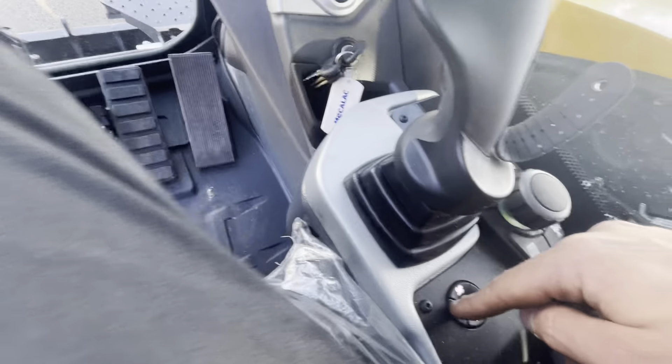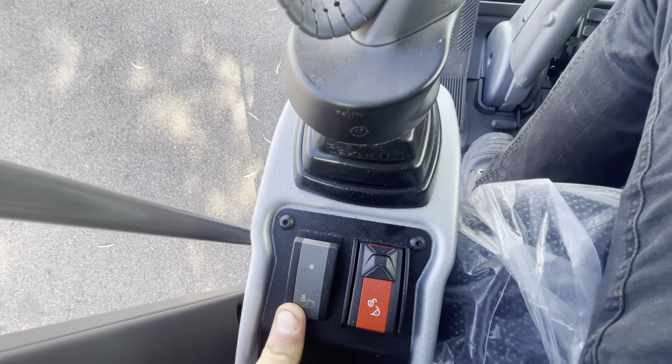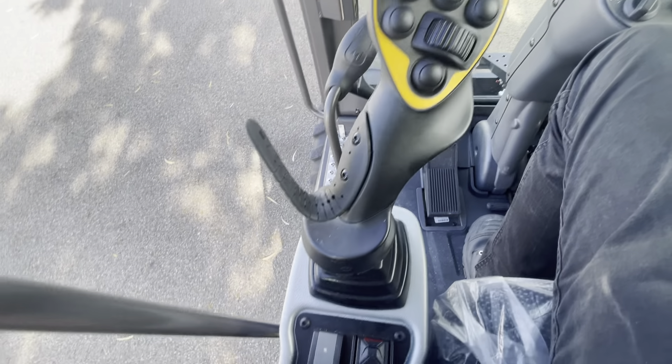And then on here, this red switch — this is for the top hitch, so that's to drop the whole tilt rotator off. So be careful with that because you obviously don't want to lose the tilt rotator if you're expecting to lose the bucket. And then you've got your alarm override button — so that's if you drop the tilt rotator off and you want to lift something with that lifting hook, you're not going to have an attachment on and it might be beeping at you. Hold that down for three seconds and that'll stop the machine's alarm going off. Nothing to do with the Q-safe alarm or the Engcon alarm — they're separate systems.